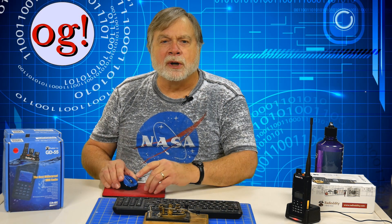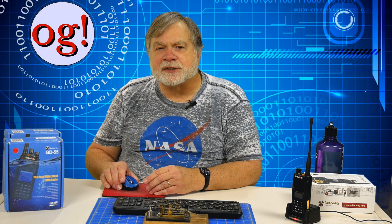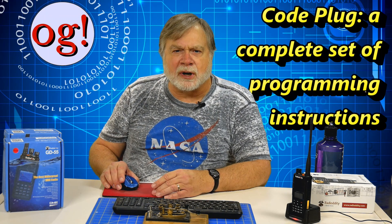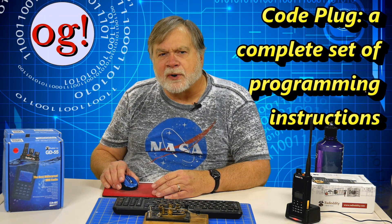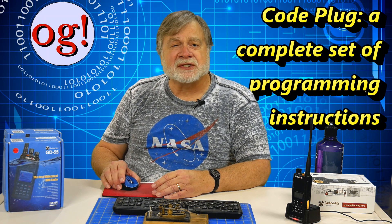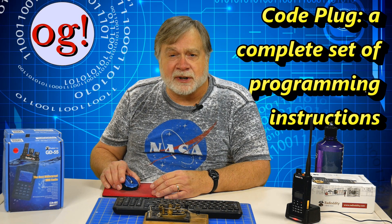Even with all this structure, it is possible to call CQ, usually by stating that you are listening to an area covered by the talk group. It's also possible to send pre-programmed text messages. Note that even though DMR is new, there's lots of structure already in place. You need your own ID code, which you can get from DMR-MARC. I recommend lots of patience. Try to get a code plug — meaning a complete programming file — from someone else who is on the repeater, or at least sit with an expert and learn what needs to be done.